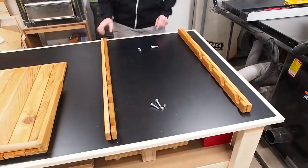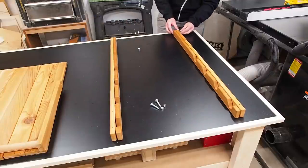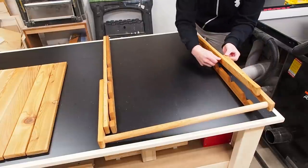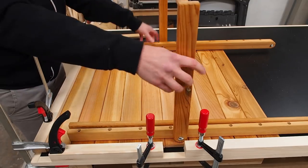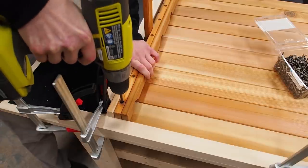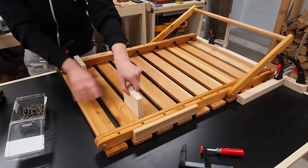For assembly I'm using carriage bolts and nylon lock nuts. With my parts laid out and the hook pieces on the inside, I simply slipped in the bolt and then added a lock nut that I'll tighten all the way to lock it in place. Then repeat on the other side with the bolt facing inwards. I can then add the swing arm, insert the bolt, and line up all the holes. To attach the back slats I've clamped some stops to the edge of my workbench, and I'll simply flip the mechanism onto the slats and push it up to the very edge. I used a leftover piece as a spacer and screwed the first slat on, then used spacer blocks to position each subsequent slat and screw it into place, slat by slat, until I reached the end.